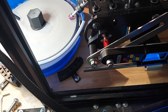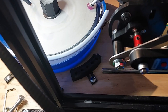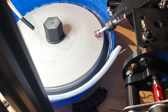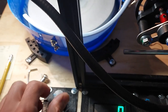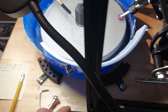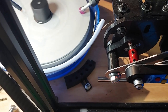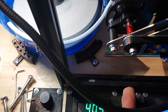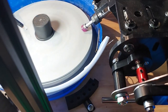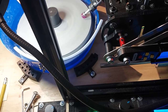All right, we're going to move on to doing the pre-polish now. I've got a 14k lap and we're coming off of a 1200 lap, so hopefully these facets will be small enough that they'll polish quickly. We're going to run the same program we did to cut the different facets to polish them because it'll line up. First thing I always do is turn on the drip. The program will lift the stone up, rotate the index back and forth, and then put the stone back down. I like to run this lap around 600 or 700 RPMs. This is synthetic corundum so it needs to be running pretty fast.